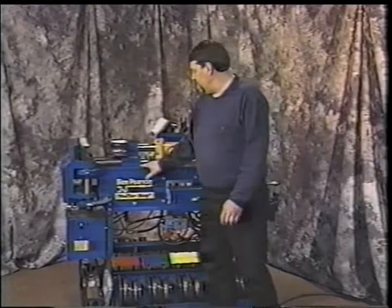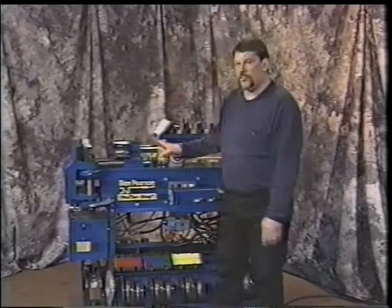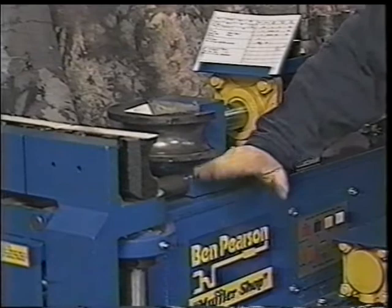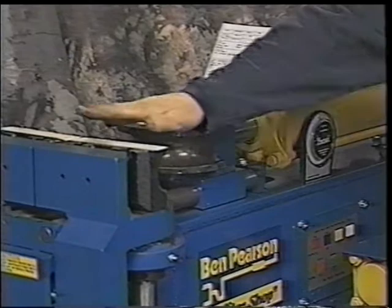In other words, because of the business that we're in, if you're pattern bending some tubing, you'll get some rust or some sand or whatever that'll drop down on these shafts. You want to make sure to keep this lubricated with a light spray like a WD-40 or a JB-80 or something of that nature. You don't want to have a heavy grease on here so that it catches all that sand and rust, etc. Because there are some bushings in here that go around that shaft that keep this pusher die plate nice and tight on the shafts. And if you get a lot of sand and gravel or whatever in there, it'll wear those bushings out. Then you'll get some play in this pusher die, and when it doesn't meet these properly, it'll wrinkle the tubing.